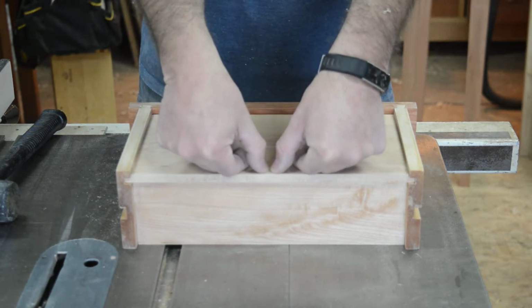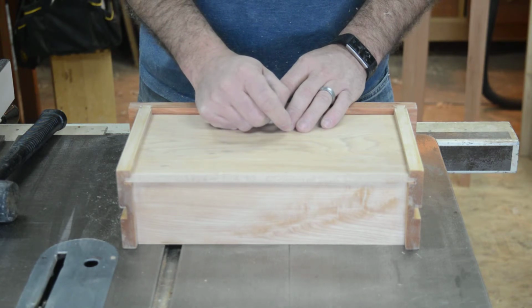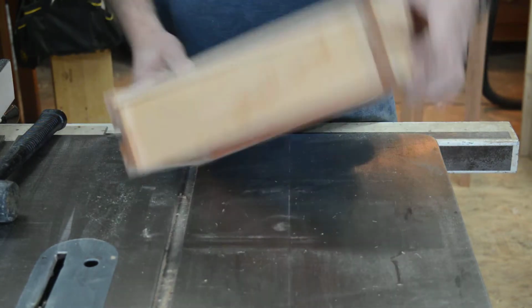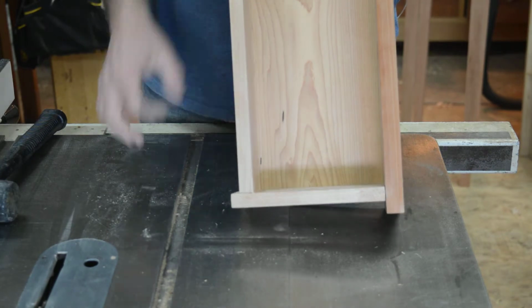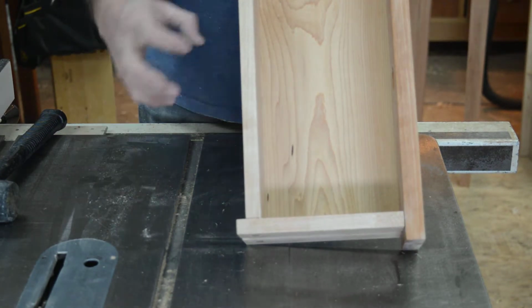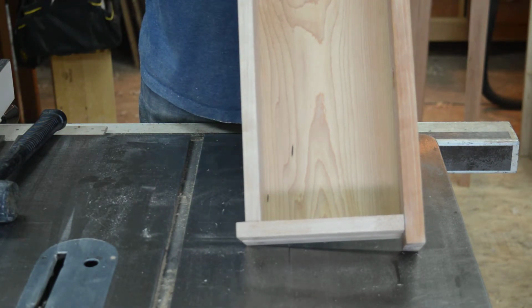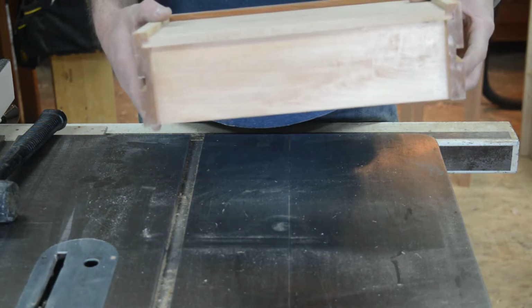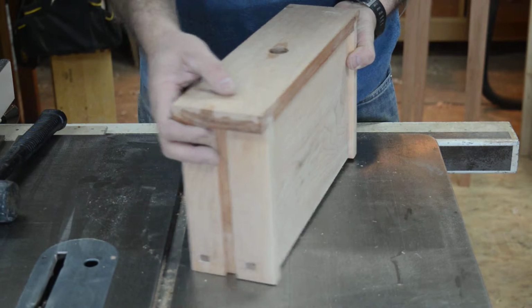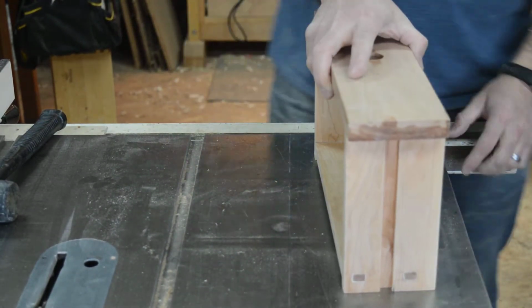So I've got to elongate that hole, but all of that starts with where I need that first hole to start. By marking there and there, I know exactly where the thickness of this back is, and then from there I can pull out the bottom, drill a pilot hole through the underside of the back, and then we land that screw. Depending on how well fitting your drawer bottom is, pulling this thing out could be tricky.